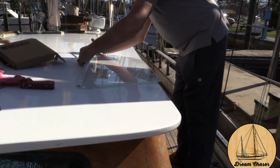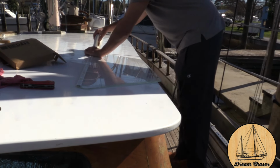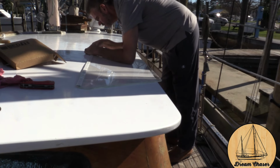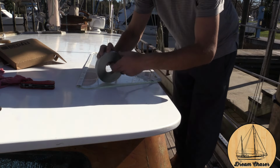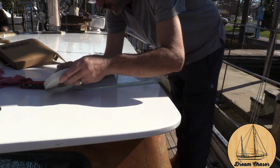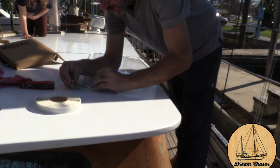I decided the way I would go ahead and seal this is to use butyl tape on the inside of this window. I didn't show a close-up of the frame, but essentially the exterior opening is about a half inch to three-quarters of an inch larger in diameter than the inside opening, so this glass just sits right up against that. So again, using butyl tape on the inside of this, and then instead of just allowing that only to seal it, what I'm going to do is essentially build a frame that's going to go over the outside and hold it in place, and I'll put butyl tape on both sides. Again, this is really a temporary solution. It's got to last us another 30 or 40 days, and then I'm going to spend a good week and rip that coach house wall out. It'll be a major job, but that's when we'll do it.